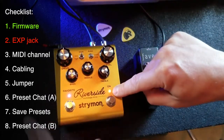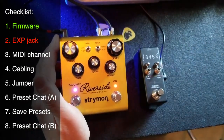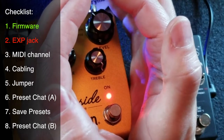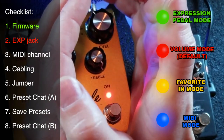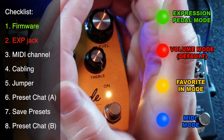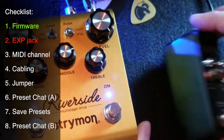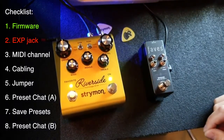Once it stops blinking you can let go. We're going to be looking at this LED — it might be red or amber by default, it's hard to tell through video. But you can see it lighting up: red, green, amber, and blue — these are different configurations for that port. We want blue, which is MIDI — that's basically the knob all the way up. Once you have blue, tap it one time, it blinks, power cycles, and that port is now configured for MIDI.